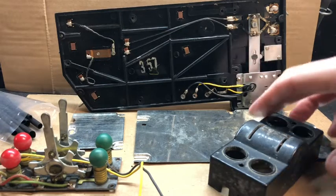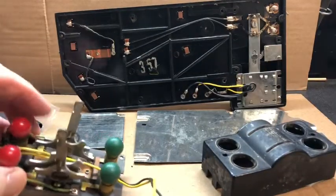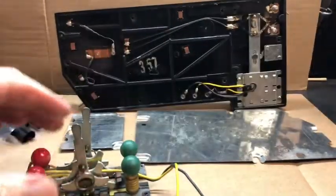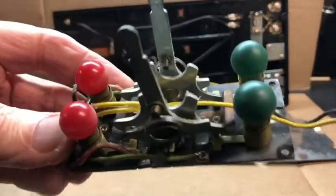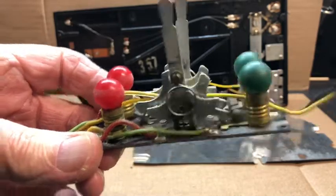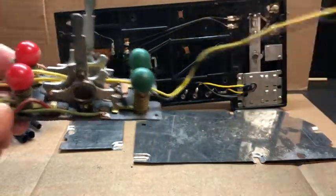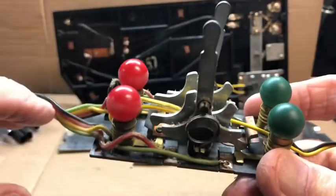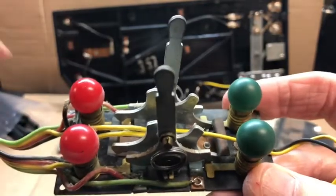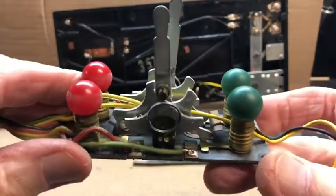Let's start with the dual controller. By removing three screws on the bottom plate I was able to free the interior part of the controller from the cover. The cover can now simply be washed, cleaned, and conditioned with CRC 226 or whatever you prefer. This is what the inside of the controller looks like — a little complicated mess of switches and wires, but it's pretty simple in the way it works. I inspected the wiring on either end and snipped off the old exposed wire on both the power connector and both of the rainbow multicolor wires, and I'll do a full-length inspection including washing them.